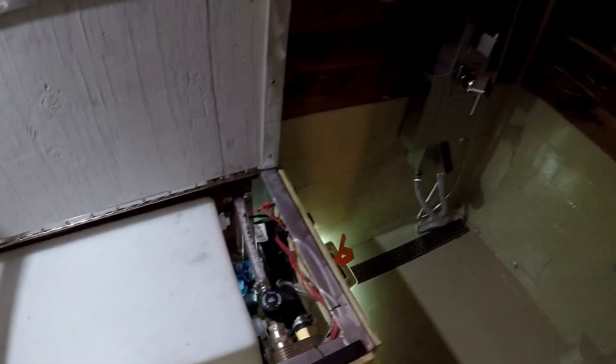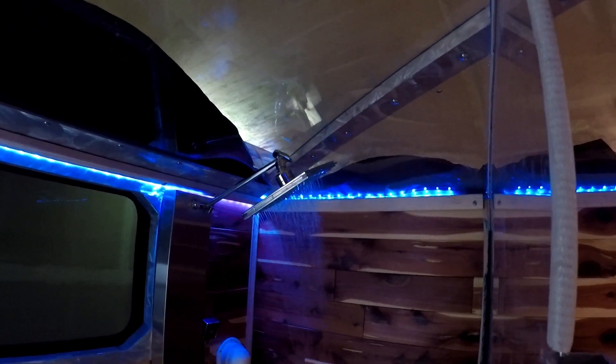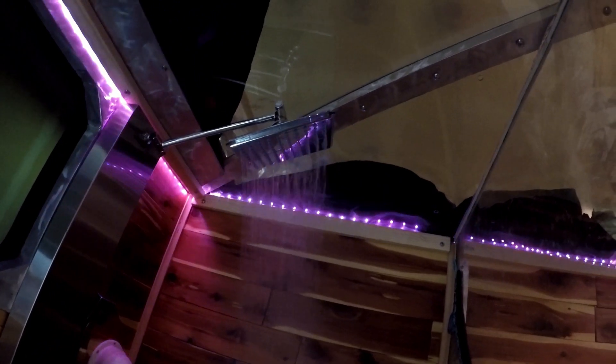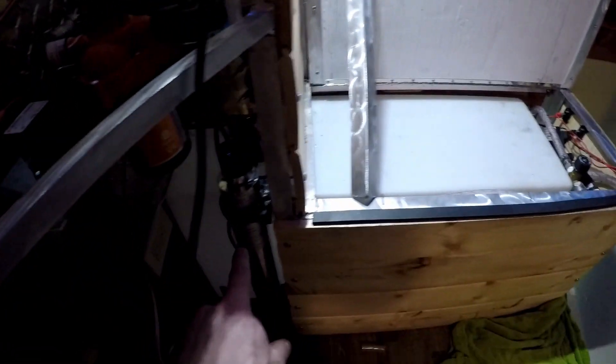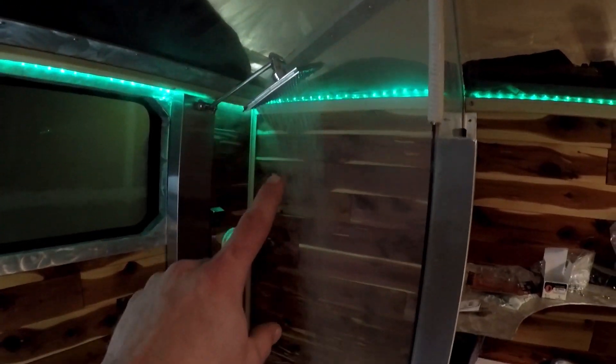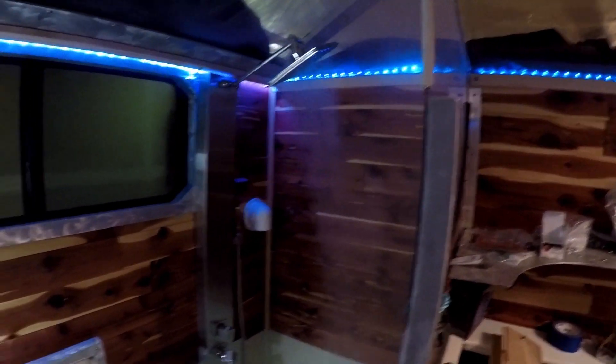The glycol goes through the entire system through the floor, and this is the cool part — this is what we use for hot showers. We have a three-and-a-half gallon pump that pushes the water through all of the filters, sterilizer, and into the shower mixer. Then we have a secondary pump that pulls from the drain and sends it right back into this tank, providing us a recirculating endless hot water system. In theory, we can get a month of showers off of one nine-gallon tank.